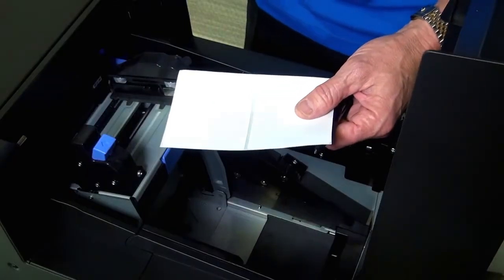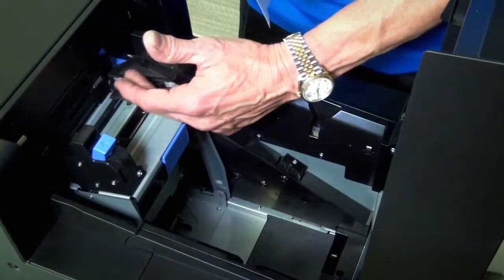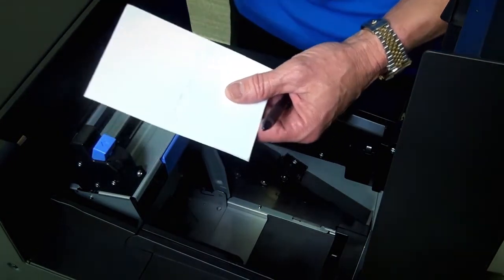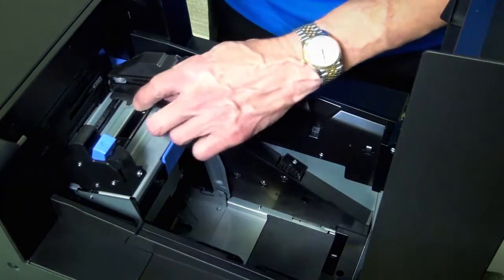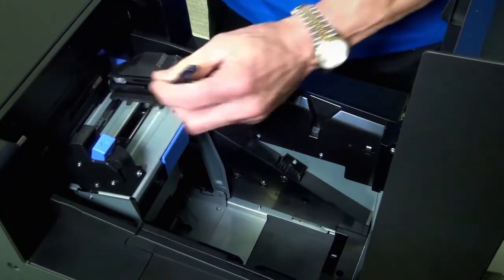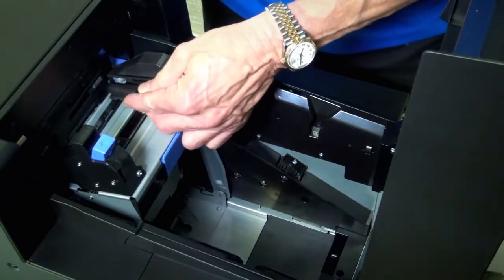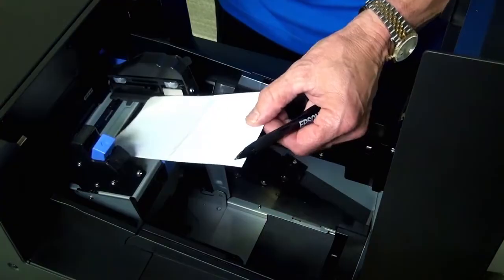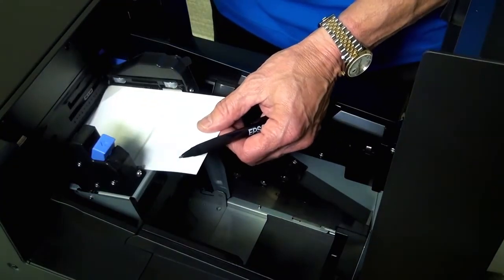One of the great new features of the 6000 family is this adjustable gap sensor. So it allows us to handle irregular shaped labels. Like in this case, we see there's a notch. So we've got a detector and sensor right here, and I can actually slide them to different positions, just being careful to move the top and the bottom to the same location. And now my C6000 is ready to sense an irregular label.